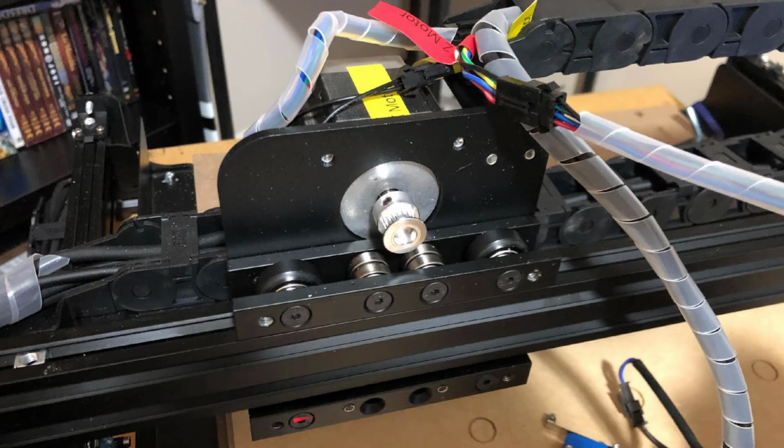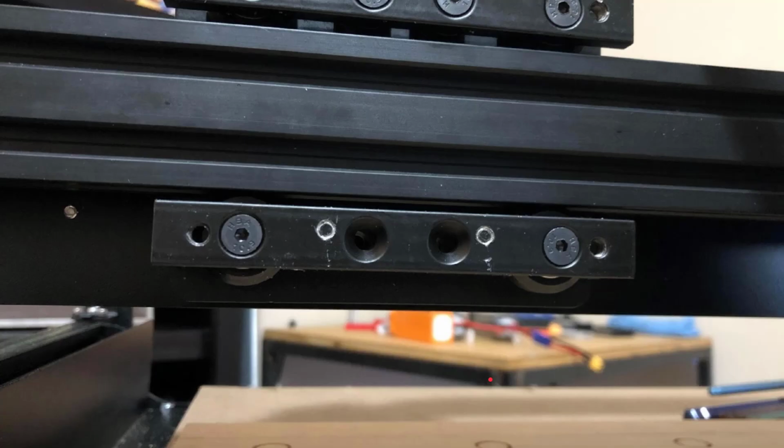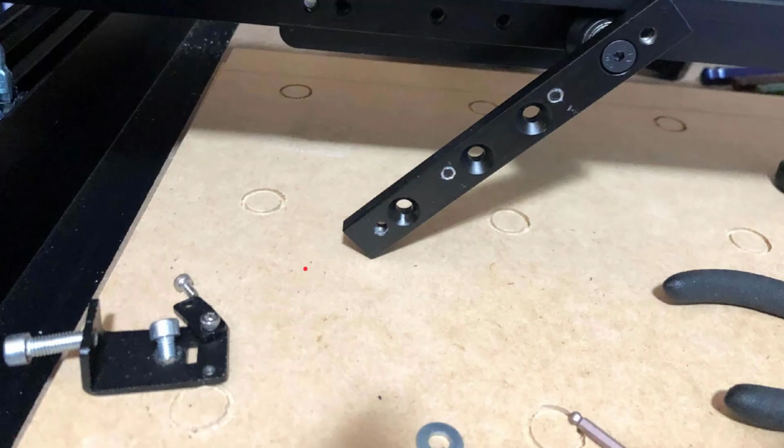We're going to focus on these 2 screws right here. I recommend doing one at a time. I found this to be a pretty smooth way of doing this, again, on multiple parts of the machine. Loosen one bolt, you'll get the old black wheel and 2 washers. Set aside the old wheel and put back the new wheel sandwiched between the 2 washers and tighten that up.